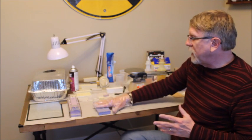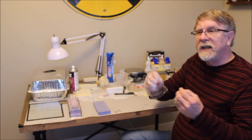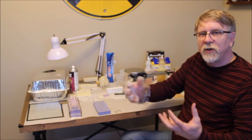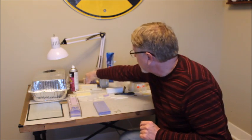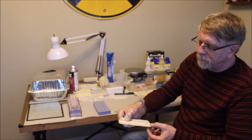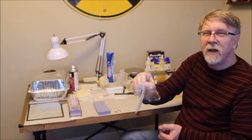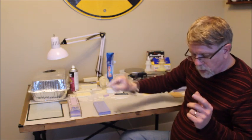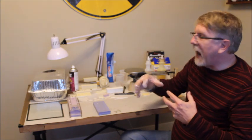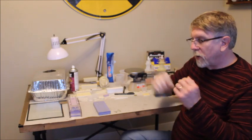The resin that you're using is an exothermic resin. What it does is as it cures, it generates heat, and the heat causes it to cure. It's kind of a self-fulfilling prophecy. The problem is that in these thin castings, like we like to use for the model railroad stuff, instead of a big block casting, often there isn't enough resin in there to generate enough heat for it to fully cure all by itself. So we have to add heat and heat up the casting to make sure that it fully cures, and even the thin areas are warmed up.